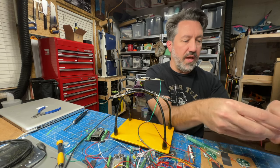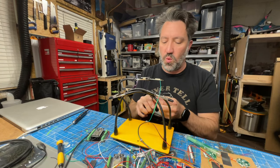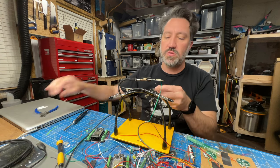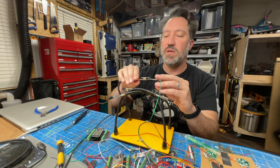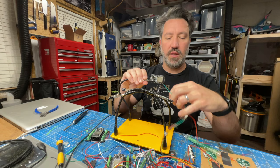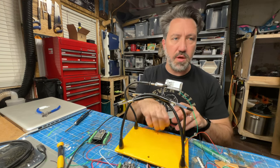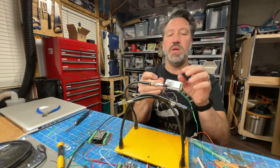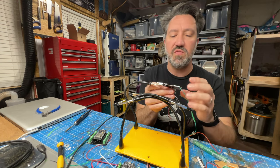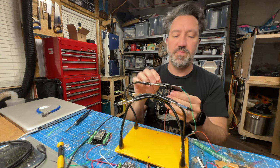I want a little bit of length for power connections so I can pigtail things together — only one wire per pin, since these are relatively tiny holes. That's another reason I like thinner gauge wire: they'll absolutely fit through the tiny holes. For power input, I like using the adjoining pins — I'll use the ground next to the VIN (five-volt input), and when I need the 3V output I'll use the ground next to that one.